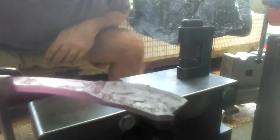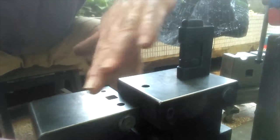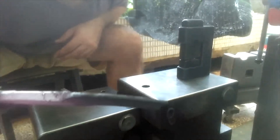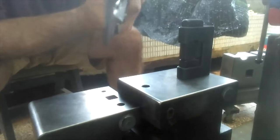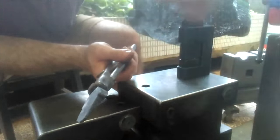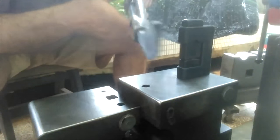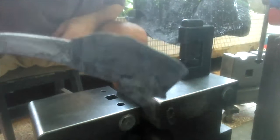A lot more curve in it now, so I guess I should have put in more curve than I initially thought, more curve in the opposite direction, but it's definitely less than in the first runs in the last video. It has a little bit of waviness, so I'll have to work that out, but to me, it's pretty thin. I'll show it to you a little bit later. It's got that little nub on the end from when I put that pre-curve in, so I'll get rid of that. But yeah, it's definitely hollow, it's definitely got taper, it's definitely pretty straight. So, yeah, that's that for the forging.